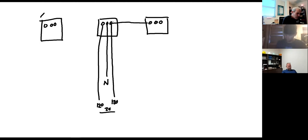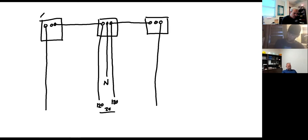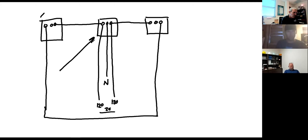All right, and like I said, we are just going here for identification purposes. Here is my fourth and last leg, and you can actually join these right here. Identification purposes: you see three transformers on the pole, and this center one has a neutral and two hot legs coming out of it straight down. What is it? A Delta. Make sure you're descriptive. Closed Delta. Really, in simplicity right here, that's closed Delta that you're looking at.